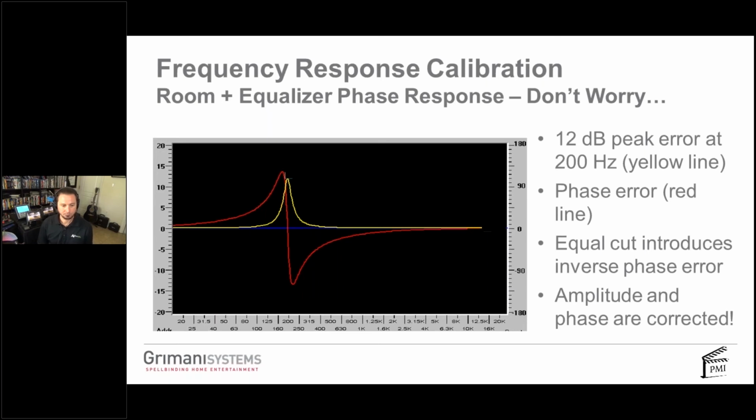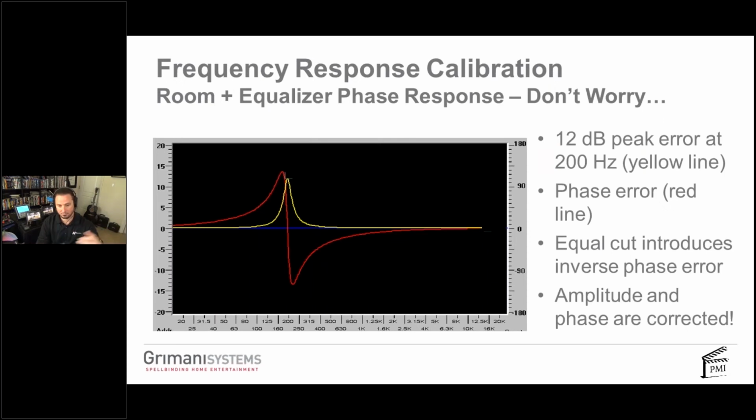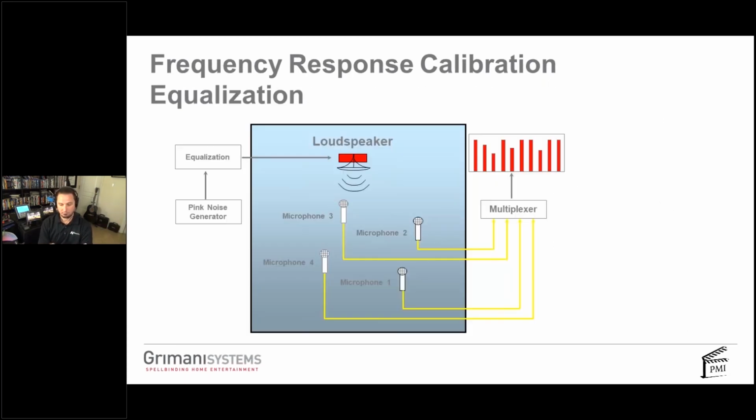And with Room EQ Wizard, you can actually look at the phase response of the system. Nice. So you can measure it. So easier. Right. So you can measure it and you can see it's all screwed up, and then you can equalize it and you see, hey, did I get any better? And again, you just do the opposite, right? So they cancel out. Yeah. They cancel out.